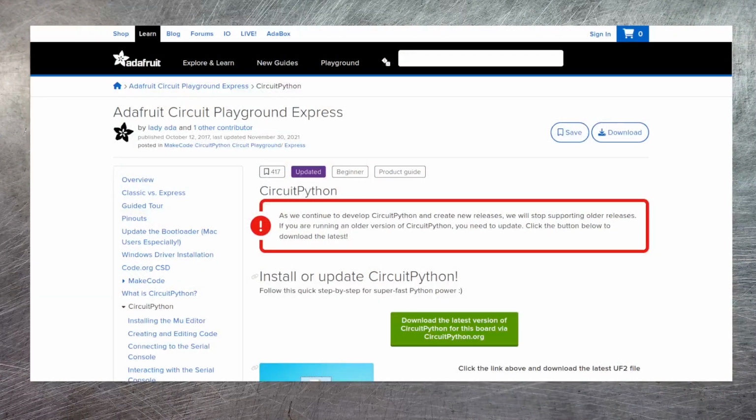Now let's get going. When you first get your Playground Express device and you connect it using a USB cable onto your PC, it will be in what's called bootloader mode. And when it's in this mode, you can't actually do an awful lot with it. You have to install the CircuitPython firmware in order to give you an environment that you can run your own Python code. You can download the CircuitPython firmware from here. All you have to do is click the green button. And I'll put the link to this, along with links to anything else you see in this video, in the description below.